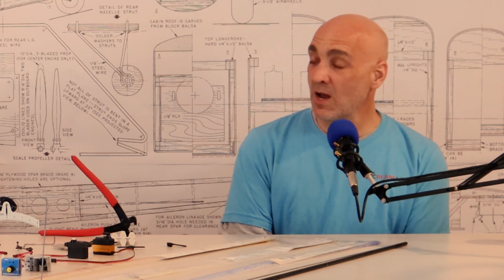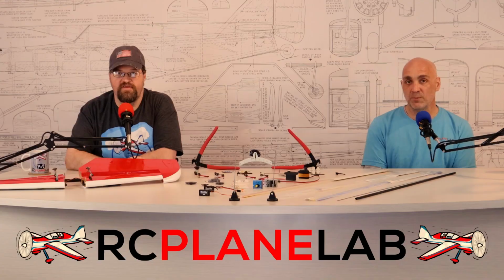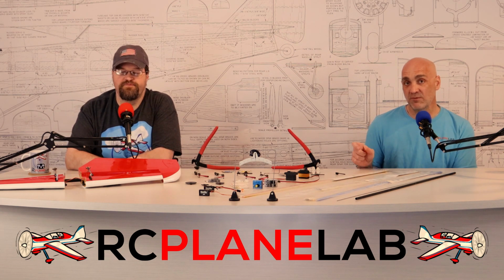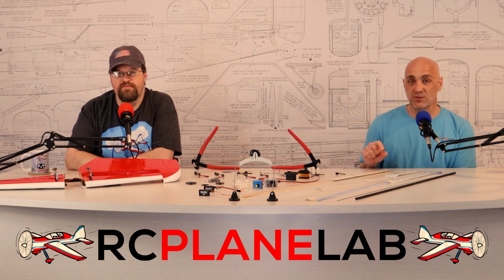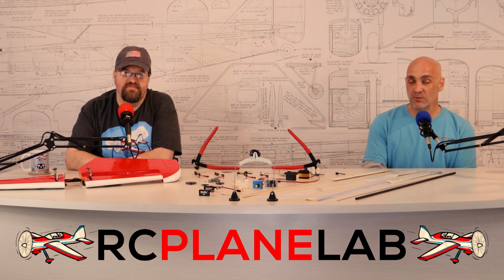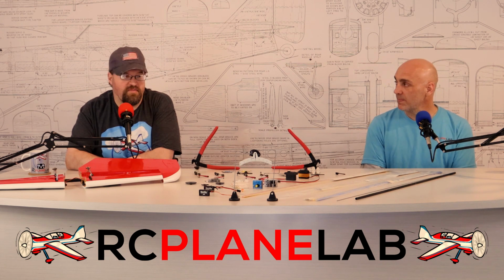That's a little bit different. That's something where you're basically adding threads to the end of a non-threaded rod via a solder-on link. So basically, if you can imagine, it's a short piece of brass usually. Half of it is threaded, and the other half has a bored hole in the end of it, designed to slide over your 256 rod, for example, and then be soldered in place. So then you now have threads at the end of your push rod. Almost like a plumbing joint.